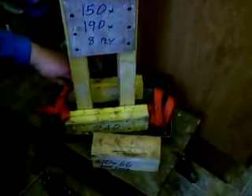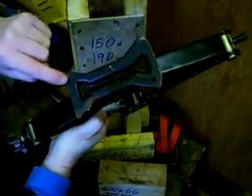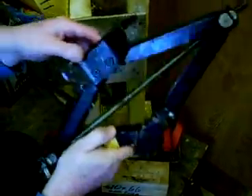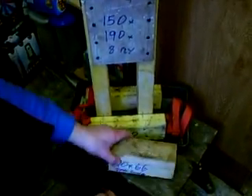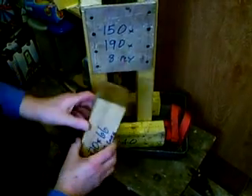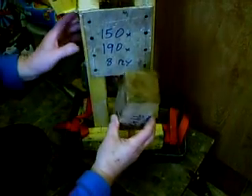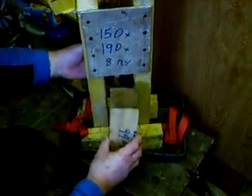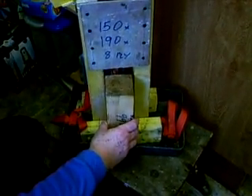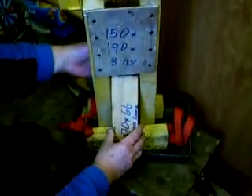The jack is normally fixed to the frame with two screws. I have drilled two holes in the base of the jack and there are two little screws that I've taken off. The piston is a piece of fence post — three-inch square fence post — but that can be made from the same material as the rest. Just two pieces of that screwed together and planed down would give exactly the same results.